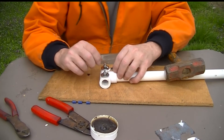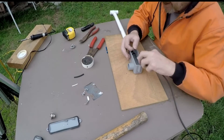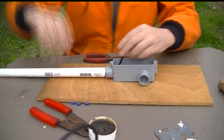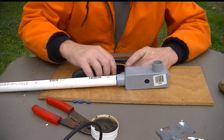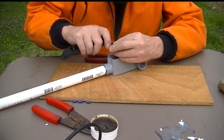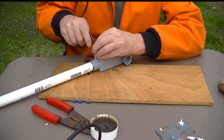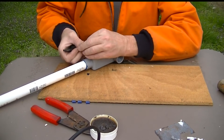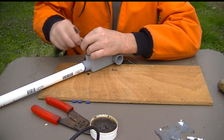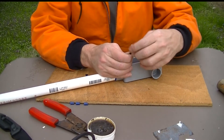We'll be sealing them both up with lots and lots of liquid electrical tape. Now we come to the other end — we have enough for another antenna. Razor blade knife. It's not as easy to roll this so I'll just go gently. When you bend it like that, it puts stress on the plastic jacket and it helps tear once you get that cut going, so that you don't actually have to press the blade all the way down into the conductor. This one is copper — some are copper-clad aluminum, those will cut very easily. Same thing as before: tear that shield apart.